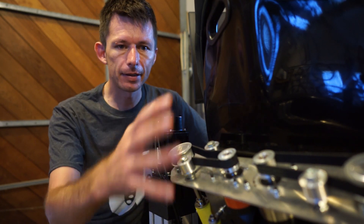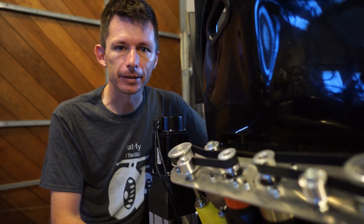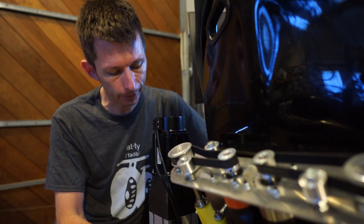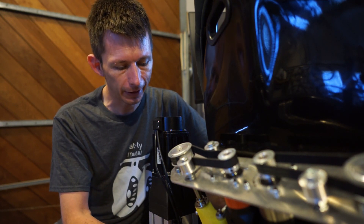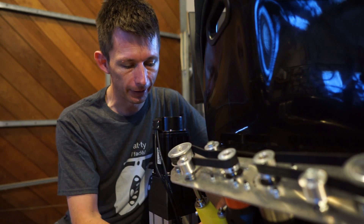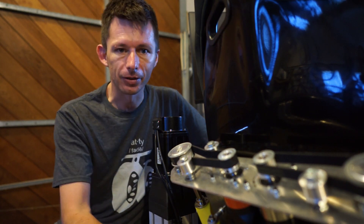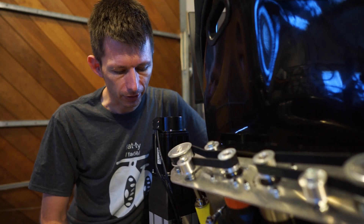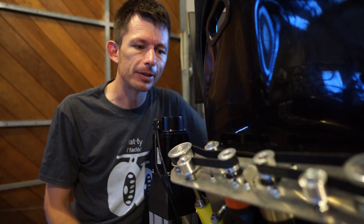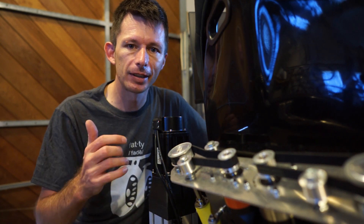So that's the back of the seat. In a couple of weeks, I'll have these new parts I talked about, and hopefully that will all be functional. Once that's all functional, it's just the aesthetics of tidying it up. This rod here is only mild steel, so it's flexing a little bit, so I'm going to add another pillow block bearing to add some stiffness into the system. There's a bracket holding the motors in that I'll design slightly better, and then finally fix up the metal flap mounting points — currently just MDF and standard butt hinges. I'll tidy that up, upholster it, and we should be done.